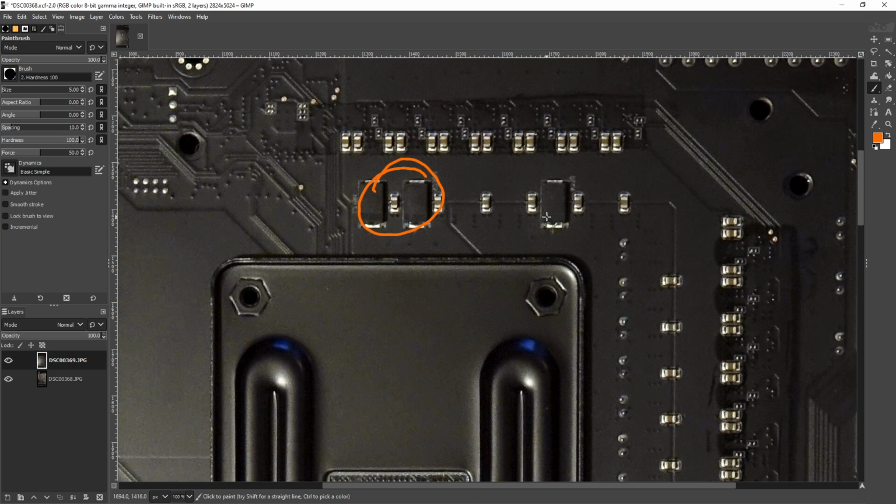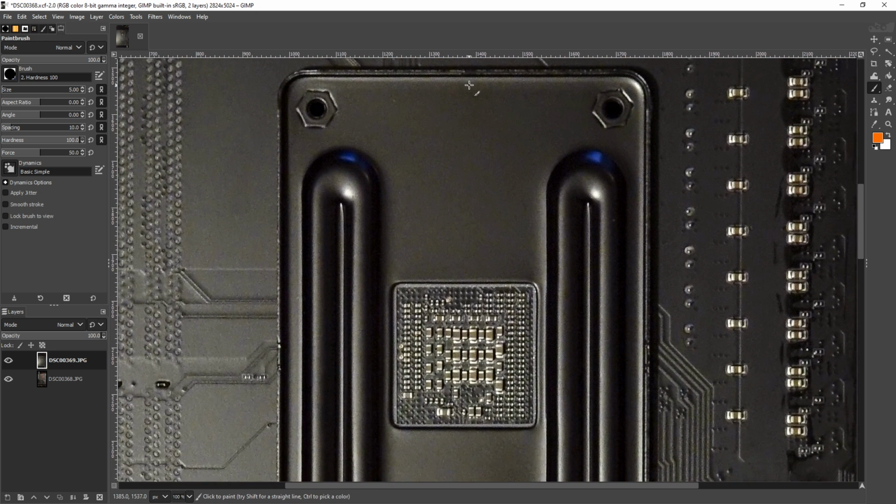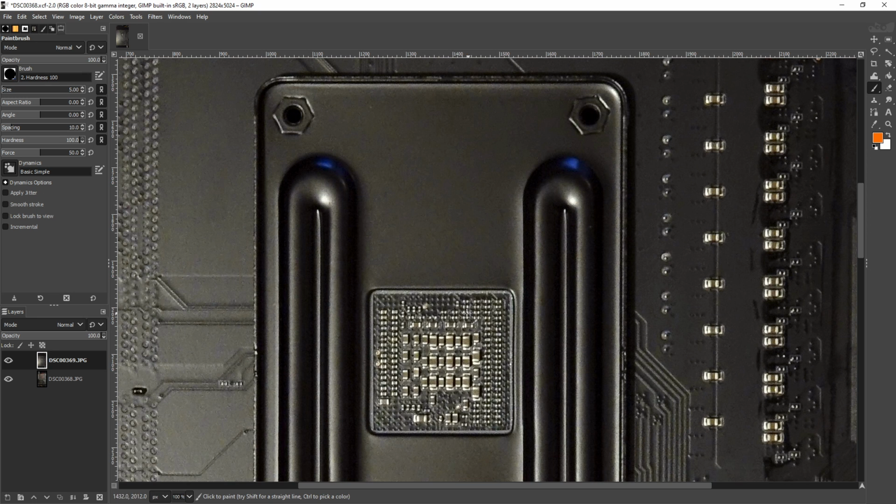That we don't really have a X570. Well, no, we do now, but not from Gigabyte. I'm kind of sad that we don't have a lot of X570 motherboards that go for an all molded polymer capacitor output filtering setup. It's always just through-hole capacitors, which unfortunately have a lot more ESL than these molded capacitors. But Gigabyte has been basically sticking to the molded polymers for the SoC rail. I'm not sure that actually has any advantages, but it certainly doesn't hurt because in terms of electrical performance, these are better capacitors than your through-hole capacitors when it comes to suppressing ripple and transient overshoot and undershoot due to the transients from the CPU.